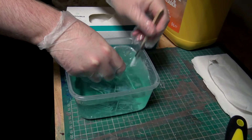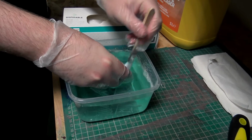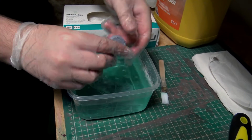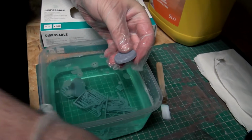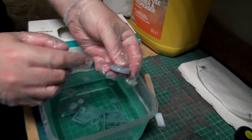This doesn't take long, but you can let the model steep for a while, or if you have an ultrasonic cleaner, you can also use that. Once that's done, the scaffolding should be in such a way that it'll just separate from the part without any issue. And it'll leave a little bit of a texture where the supports have come off.